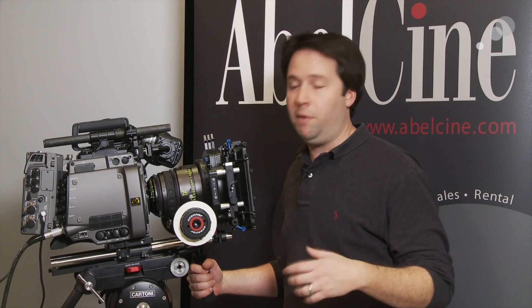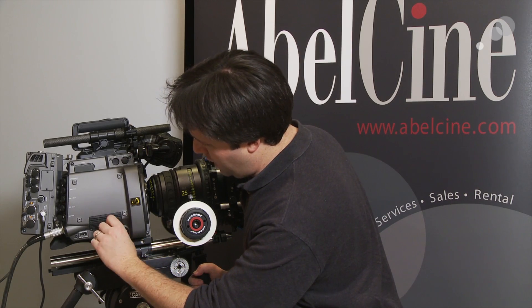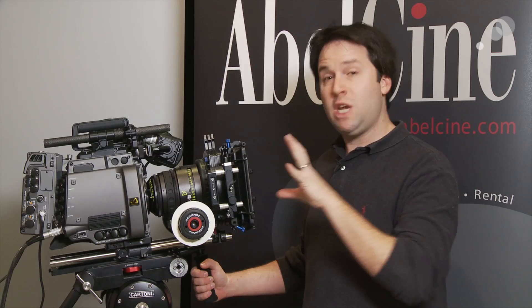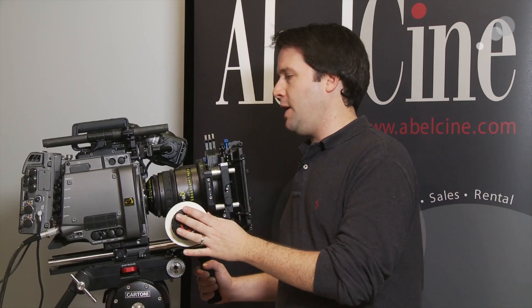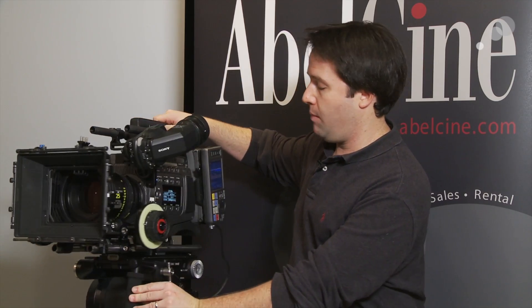You can walk around with an iPad and actually control the camera remotely, which will be a very popular option. There's an additional SDI output and two more ports — one is a lens port using the same protocol as many ENG-type cameras, plus an external I/O interface for other controllers. In terms of lens control, there is a solid shimmable PL mount on the front — not just a worm drive, but an actual shimmable PL mount. On that mount, the camera can communicate with Arri and Cooke lenses, passing lens data through, which will be stored in metadata on the camera recording.